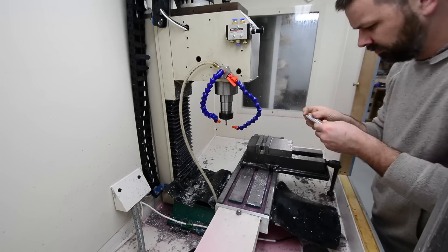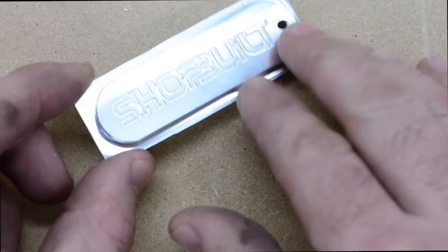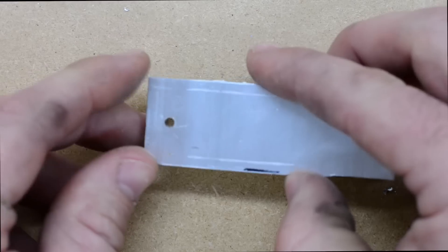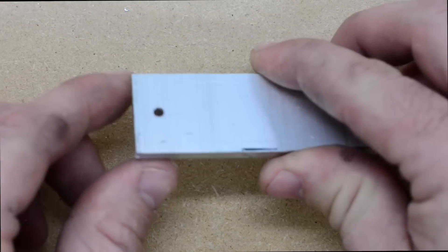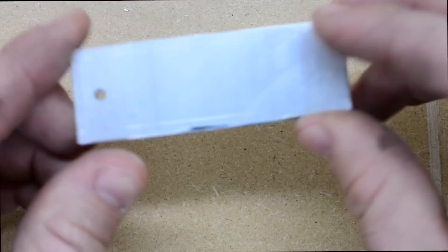That's the first operation done with this little keychain. Common practice with these CNCs is to mill the top part and all the operations you need to do on the top, and then flip it over and remove that top hat part. Now I'll be able to get a zero origin by referencing off of this hole and then machine right down and put a nice chamfer all the way around — so that's what I'll go ahead and do now.